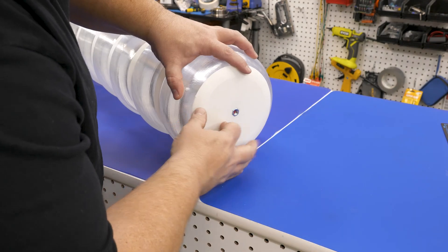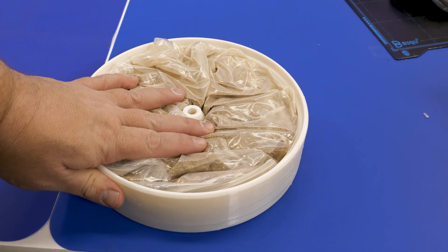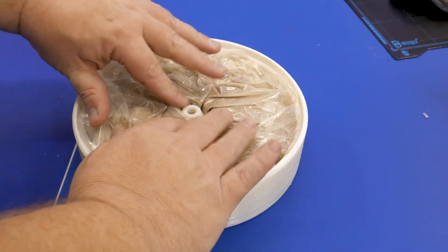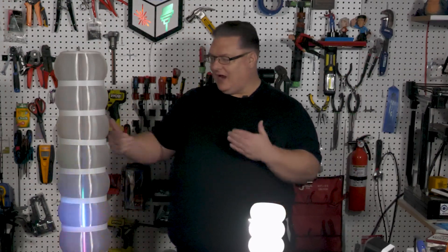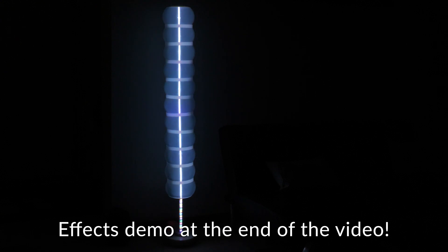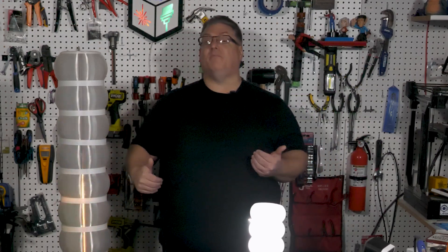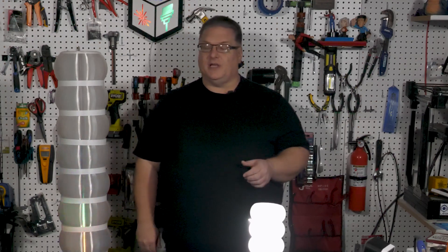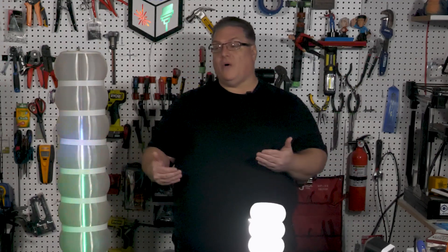Make sure there's a nice tight fit to everything. You don't want a lot of slack here because with all the weight, that threaded rod won't hold a lot of weight unless it's nice and tight. Once you're all done, pull the base off, take some plastic bags with some sand, throw those in there, put the cover on, put that back onto the lamp and you're all done. You can see I've got the sound reactive version on now — this is pretty cool. As I talk, you get the center gravity bars. There are so many different effects that WLED has for audio. I really recommend you do the WLED, and that electronics bay in the base is plenty big enough for a breadboard, so you could easily use WLED without any soldering at all.